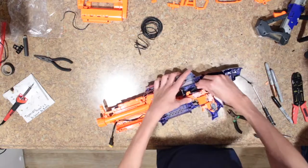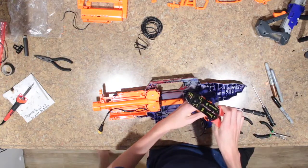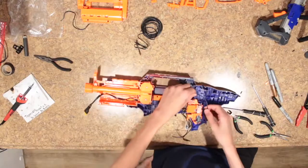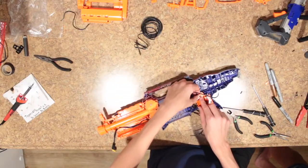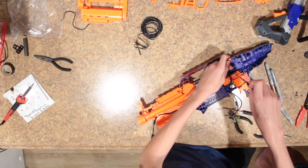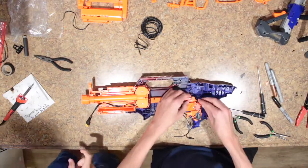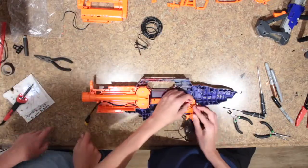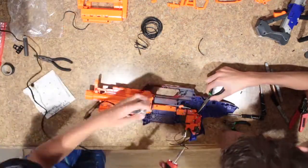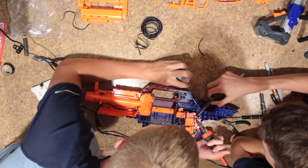Let's go ahead and get our spliced wire soldered on — we're going to strip it. Before we attach our spliced wire, it's going to the second switch. The spliced wire is going to the normally open, which is this tab here — it's the one immediately next to the tab on the side of the switch. There's a side one, and it's on the bottom next to the side one. We can cut it here, then strip it, and once you strip the wire, you can go ahead and solder it on. Also, just be careful with your switch plate if you are using one, because 3D printing is not the most heat-resistant material.